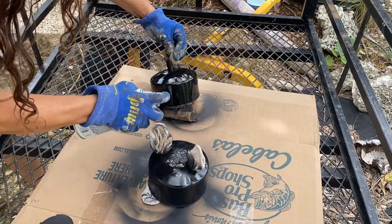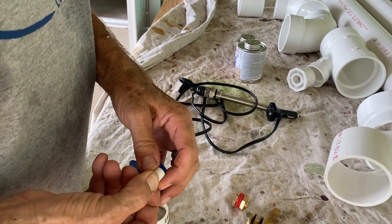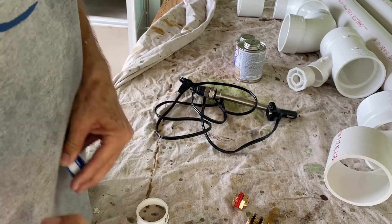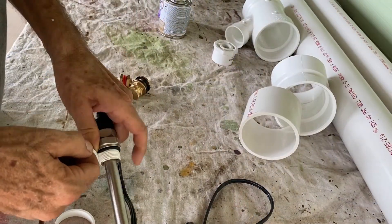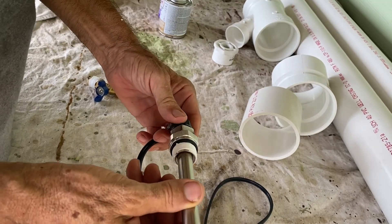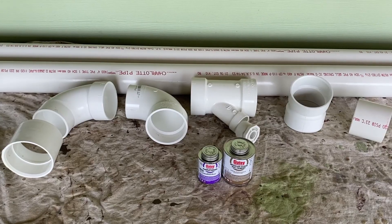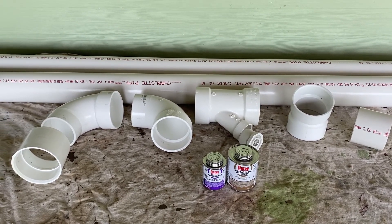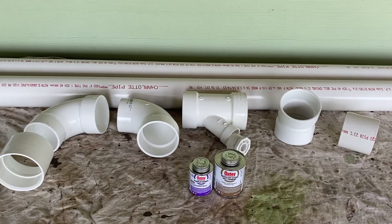Nora's doing a nice paint job on the end caps. We're going to use lots of plumber's tape because the shower system will be pressurized to 30 psi, and we want all the fittings really nice and tight. We put about five wraps of plumber's tape on each threaded component, always threading clockwise with the threads pointing towards you. The heating element has five nice wraps for a tight seal, plus the rubber gasket on top — double protection. It's all standard four-inch schedule 40 PVC, chosen because it's thick, strong, and helps insulate to hold heat and provide substantial volume for long showers.